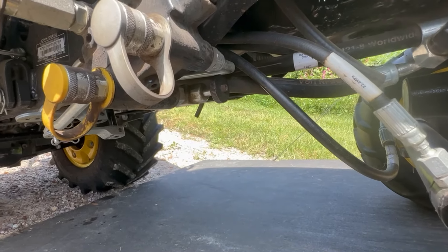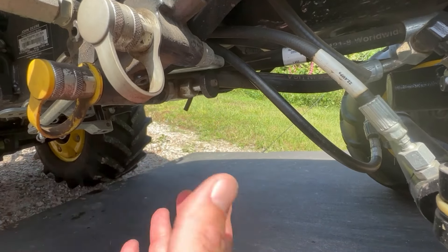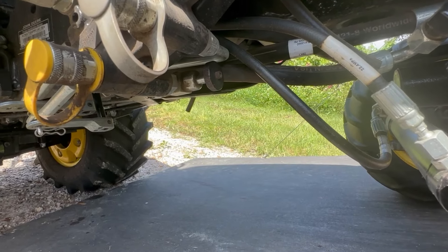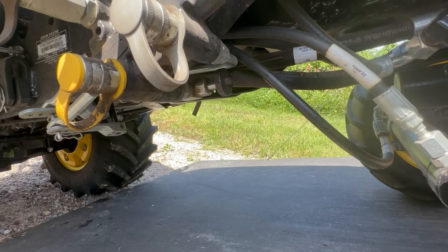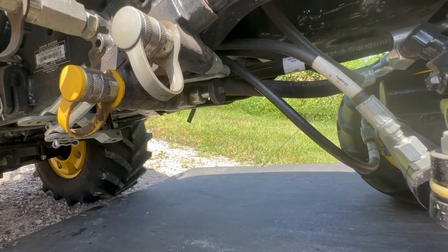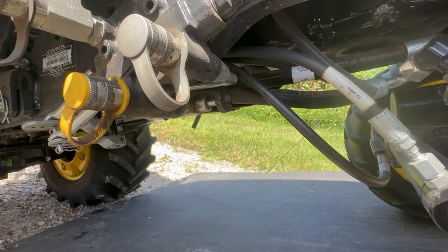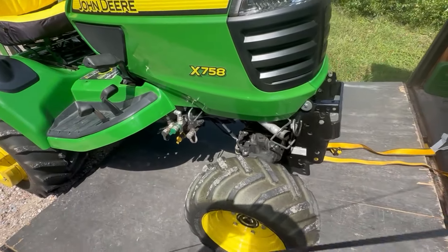I found that I had mine all the way closed — screwed all the way in. I thought, I wonder if it has something to do with that, and I thought I had changed it from when I was using my quick hitch last — turns out I didn't. So I screwed it all the way back out into the open position, letting hydraulic fluid go to the hydraulics for the lifting on the rear, and then I went to raise it a little bit more and it went right up. Really simple fix. This little knob is for changing the flow of hydraulic fluid to allow the front quick hitch to move faster.